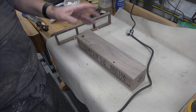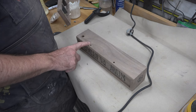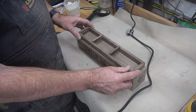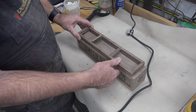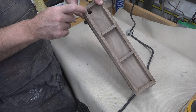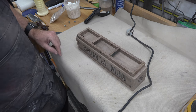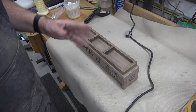It's about time that our main sign and our base meet. I've drilled some quarter-inch diameter holes in both pieces — they will line up, help me align things, and strengthen the joint so I can glue this in place. I've also drilled a half-inch diameter hole right in the corner on the inside of the base. That will be for the wiring to come down into our base to feed our LED strips on the inside.